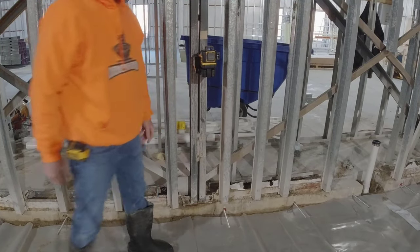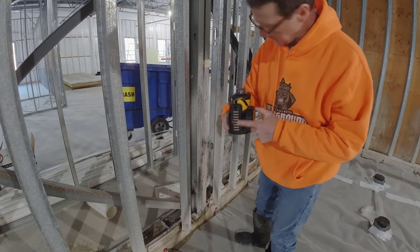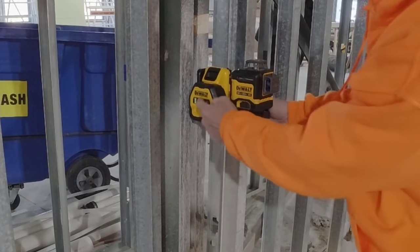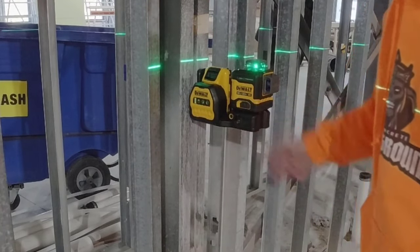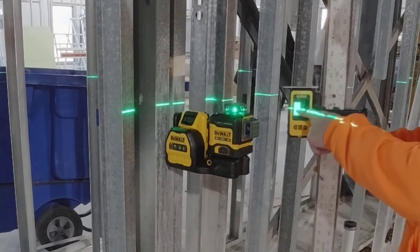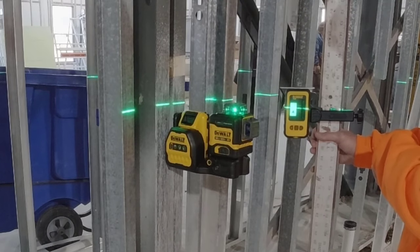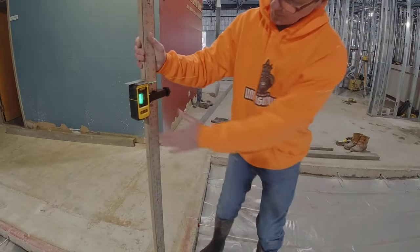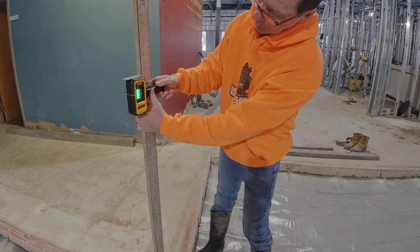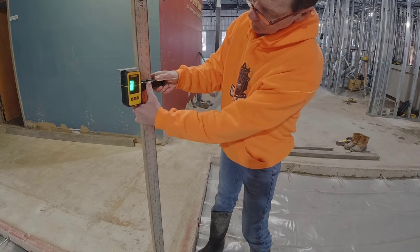I can see this part of the concrete floor right here was just about an eighth of an inch lower than the original part. Now, you can mount this on the DeWalt tripod, or it has a magnet on it so if you've got something metal close by you can mount it right to a metal beam — which is what we ended up doing in this case, to get the tripod out of the way. Now I've reset the level of the laser different from what it was on the tripod, and you can see how it tells you to go up or down.